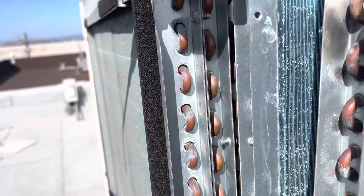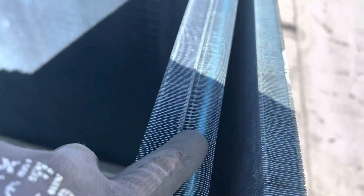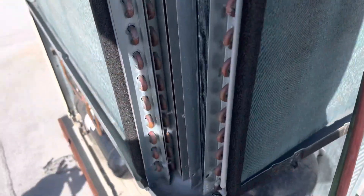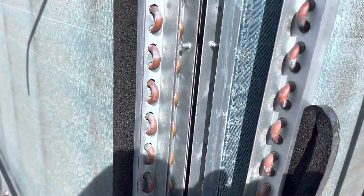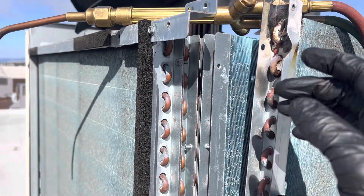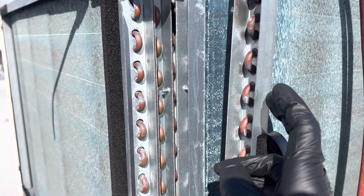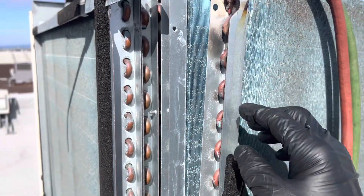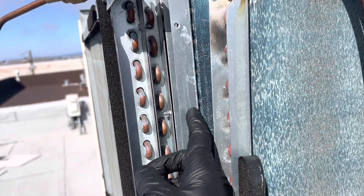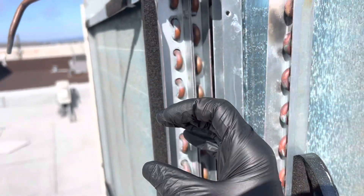You can see there's damage starting everywhere — we've got corrosion from the salt around here. This is a three-core unit, as you can see: one, two, three. When you're in salty weather, it would be good if these things were epoxy coated or had real hot-dip galvanizing where they punch the holes out first and then galvanize the plates. Instead they only do a cheap thin electroplating of galvanized, then stamp it out, which cuts away the galvanized coating.